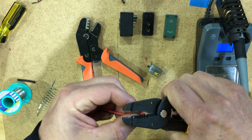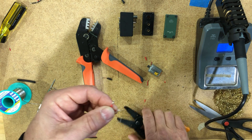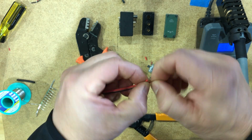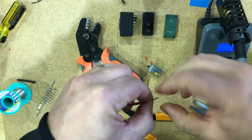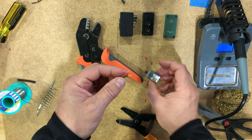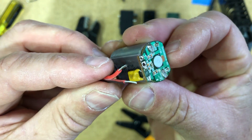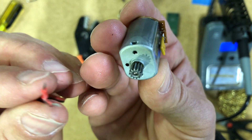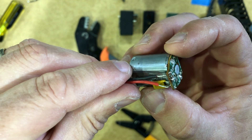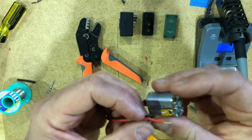So we're going to strip the ends. Once the ends are stripped, we're going to twist the wire up, and this will make it easier for us to get it back through those holes in the PCB. At this point we're going to remelt. If we look at the bottom of the PCB, we can see the solder is still there. We can see the two holes there right at the ends. We're going to remember the black one goes on the outside. All we're going to do now is remelt that solder and push the wire back up through the PCB.